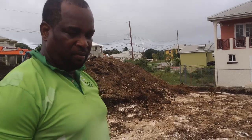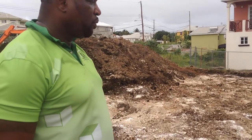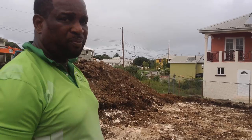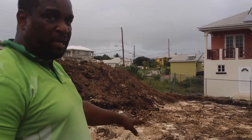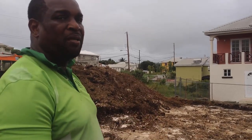We need to make sure those pockets are cleaned out properly — once you see a crack, clean it properly. When they do the excavation of the topsoil, we try to minimize leaving any soil behind, because that's not good practice. You really need to dig off that topsoil to get to that second layer. If you don't move it out, you can get actual movement in the structure. The soil is unstable and can cause settling. So you want to excavate down to rock and make sure it's cleared.